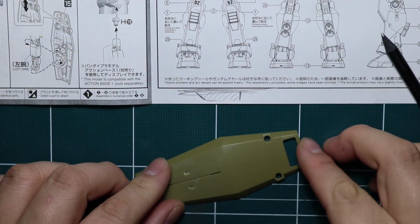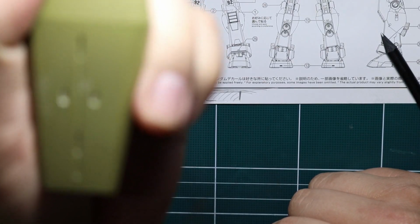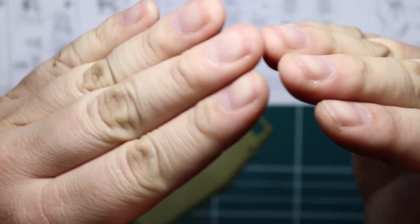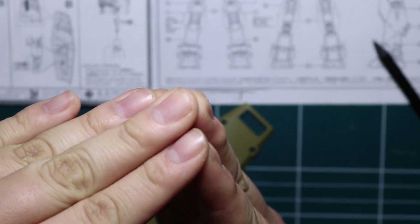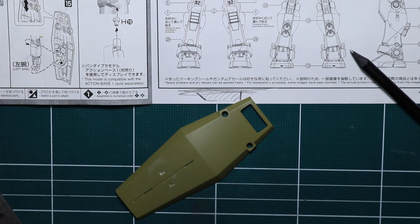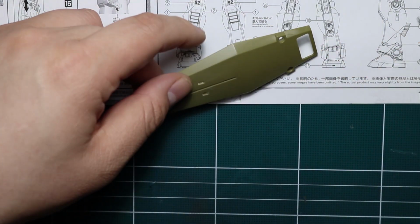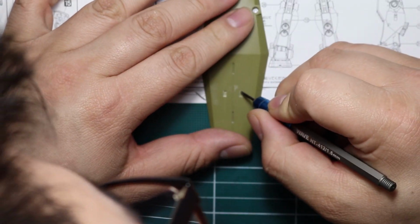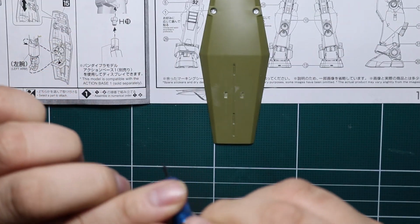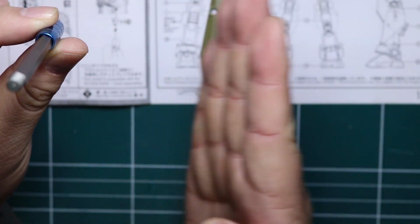And so in order to create the incline, I'm actually going to turn this sideways, and I'm going to start carving away at the sharp corner of the box. By going against it sideways, I can shave off the corner and also use the box that's inside as a stopper for that. So I'm basically just going to hold it to the side here and whittle away at it. My chisel is basically vertical this way, and I'm going to be dragging across this way.